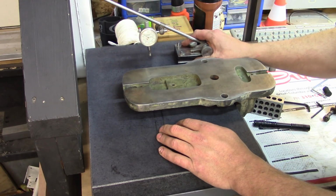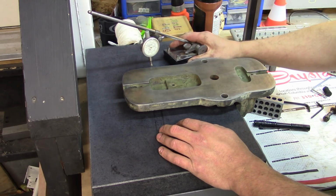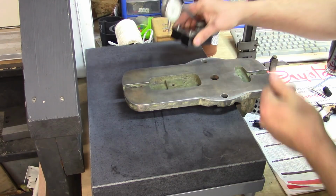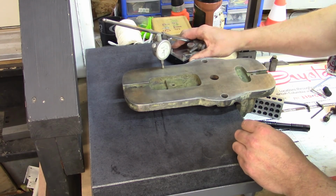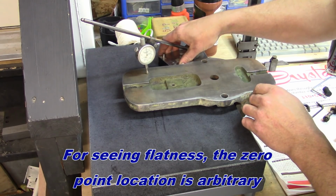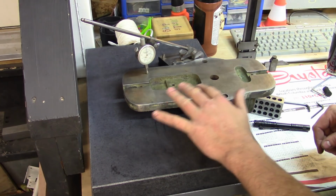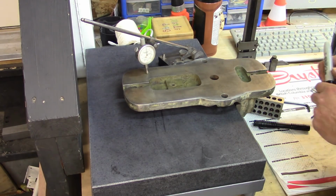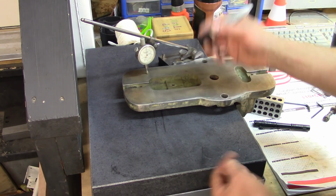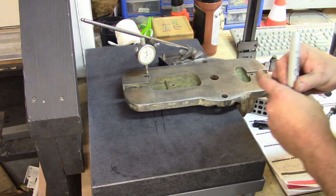And then we're going to take our surface gauge here that Doug gave us. Thanks again, Doug. We'll take it with the dial gauge or dial indicator mount on it. Call that our zero. Now this surface here has been hit with a milling machine, so there's going to be slight variation as I go along, and I'm sure I'm doing something wrong here, so by all means, I don't take offense if you make a comment, but right about there is zero.